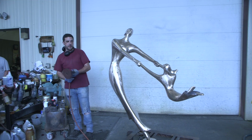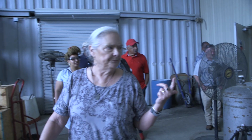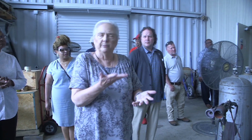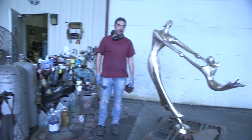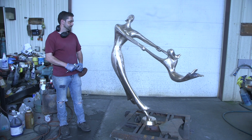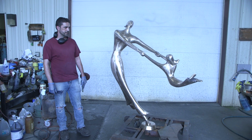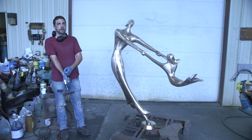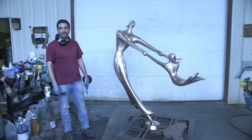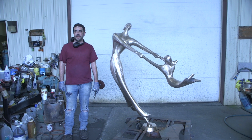So this area out here is our patina area. This is a piece that came in for repairs. The patina that was on it developed some white spots that were coming up from, I guess, the metal actually. And then the artist decided that they wanted it fixed, whatever it took. So we ended up having to cut all the lacquer and patina off, and Neil's now polishing the surface again to get it ready to re-patina. He's not real happy with me, but he didn't want to do this. But anyway, anything you want to add?